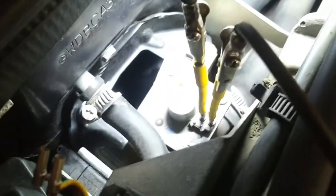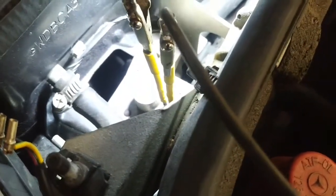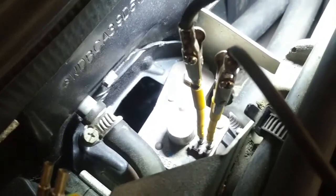That smaller coolant pipe goes off to the heated windshield. That mono valve seems to pulsate occasionally, and when it does pulsate we get good heat out of the heater. But when it stops pulsating, the heater cools off and the hoses start to get a different temperature. All the information I've read so far says that valve needs to be de-energized for heat and energized to shut off.